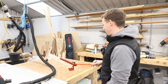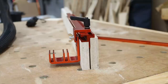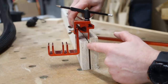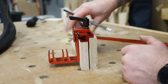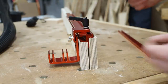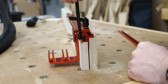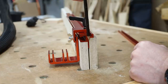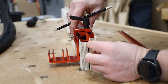A few days later and I'm back making the front fence — this is the most important one and has to be exactly right. I'm using the UJK track and stop kit, which is this piece of aluminium extrusion. It has to slip down in between two pieces of plywood and I also have to recess it into the back piece — there needs to be 10 millimeters difference between the front and the back for it to sit correctly. You could also just use T-track routed into the front and top, but I've got the kit so that's what I'm using. The height of my fence is dictated by the length of the stop. I've rough cut the pieces and I'm now going to run them through the table saw to get them perfectly parallel.